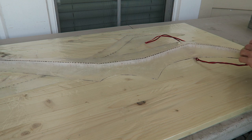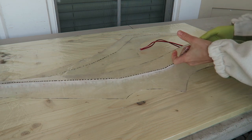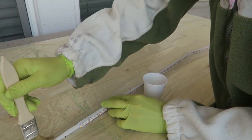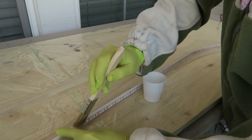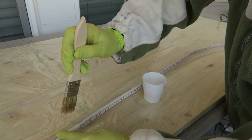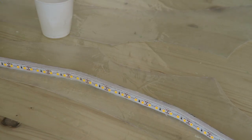I removed the tape from the outside since these were all properly trimmed and everything was aligned. Then I applied epoxy to all of the inner surfaces — this is the same tabletop epoxy as I used earlier. This epoxy is somewhat more viscous than some of the other epoxies I would normally use for laminating, and it was a cold day so it was fairly thick. However, if you just get it where it needs to go approximately, you can then go over it with a heat gun to make it more liquid again and ensure that everything is properly spread.